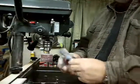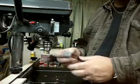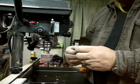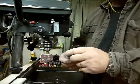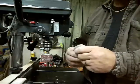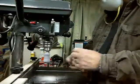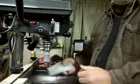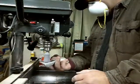Okay, we're at the point now where I'm fixing to take sandpaper and start smoothing this out. I'm going to do that process and then I'll get it to where we can do the final steps, and I'll show you that from step A to step B on the micro sanded. So now what I'm doing here is taking 80 grit and I'm actually shaping it just like you would on a lathe, but I'm using sandpaper. Now I want to round this off as much as possible.